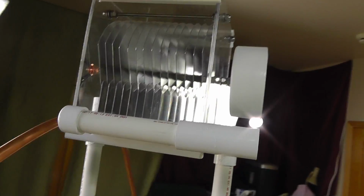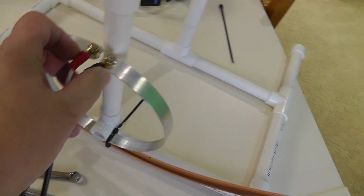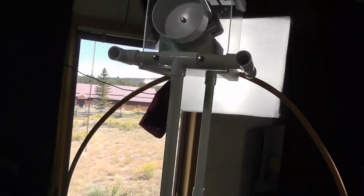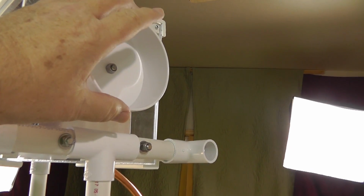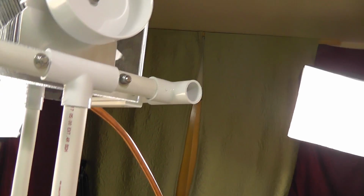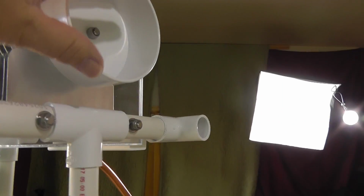Now, there's a couple things that I've noticed in tuning this. This is attached right here without any kind of balun to a very stiff piece of coax. I think they said there's 25 feet. But the problem is the tuning knob is this one up here. Now, the nice thing about this tuning knob is it's huge. Okay? And you can, for 60, 40, and 30 meters, this will tune like an ordinary loop. You just tune this till you get it right.